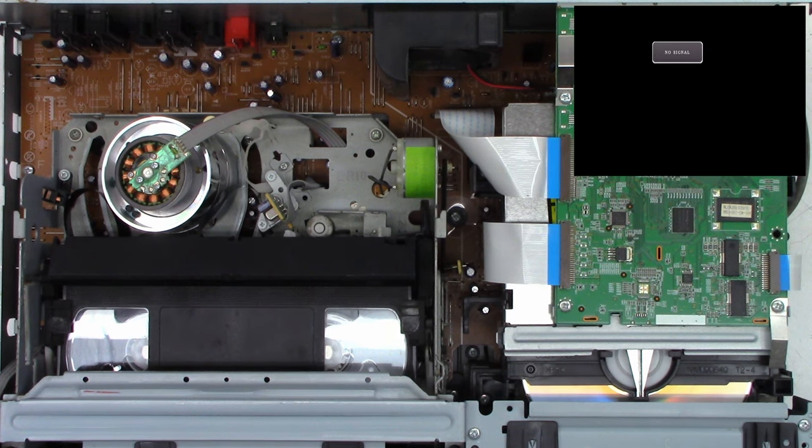And on these especially, I'm going to add solder to just that one side. And this one will get laid flat, so it doesn't really matter what side. But I really want fresh solder on one side of the capacitors because these lay flat on the board. So what I need to do is orient it in this position. So what that means is I'm going to bend one of the leads. I'm sorry that it's out of focus. I'm going to bend one lead like that, and then I'm going to come out and bend the other lead in that fashion right there.